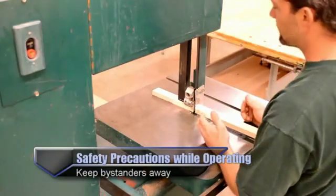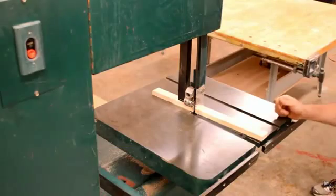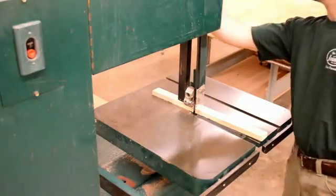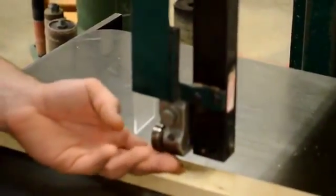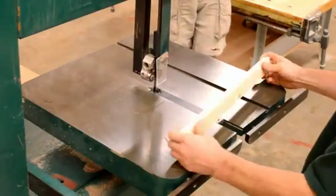That means there's less exposed blade to get caught in if somebody bumps me from behind — even if I go into it, I have some protection. Once you adjust the blade guard, on some machines there'll be a knob in the back to tighten, others it'll be on the side. On this particular machine there is a knob on the back. To adjust it, you loosen it and physically move the blade guard up and down to the height you need. Be careful — some don't have tension, so as soon as you loosen the knob it will just drop and cause damage to your material or the table, so make sure you're holding the blade guard as you loosen that knob.